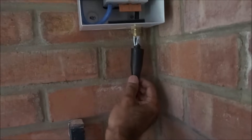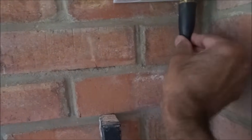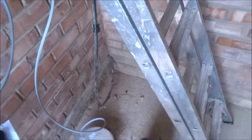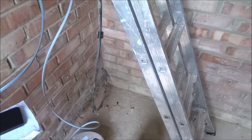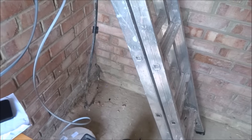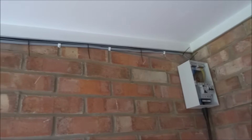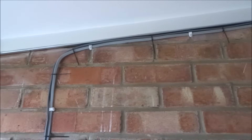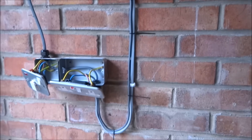The bus bar plastic cover can be pushed straight up and twisted into place. I've got some extra cable so instead of cutting from the top I'll push it back and run it a bit more towards the house. I've clipped in the 2.5mm cable for the sockets and next to it I've run the lighting cable, cable-tied them together. I'll need to buy some clips later on.